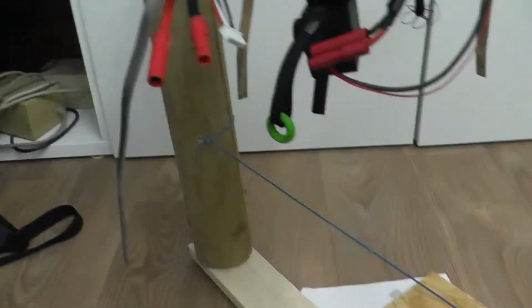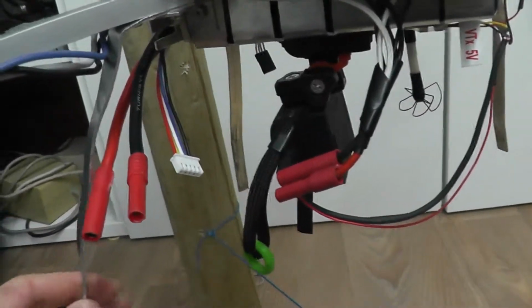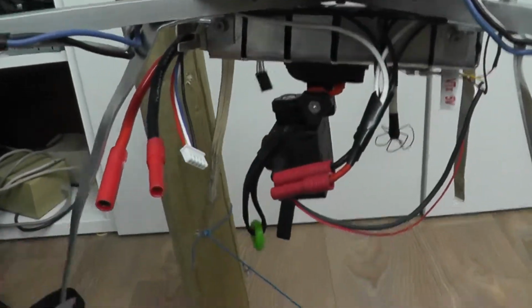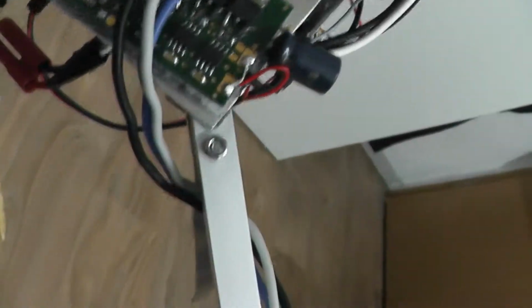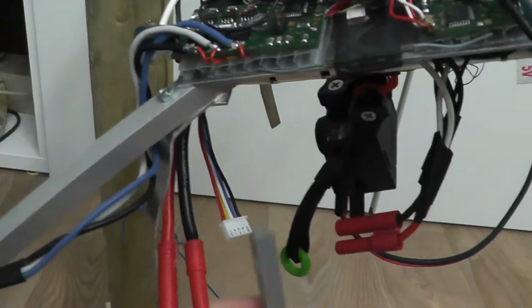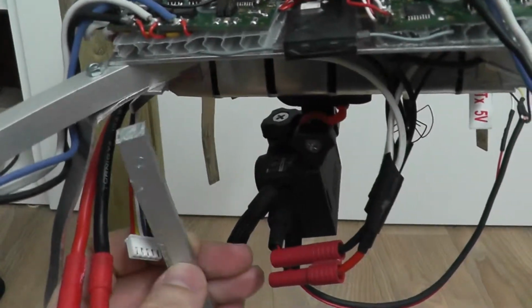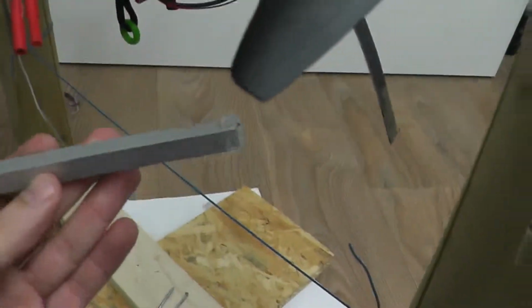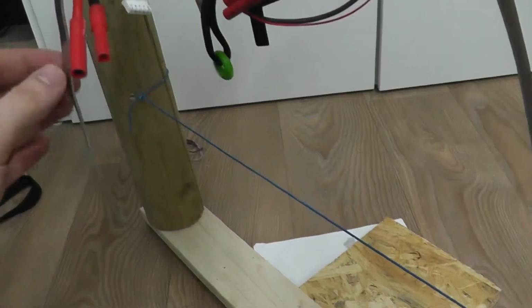So now a few words about the legs I'm using at the moment. As you can see, there are 4 small pieces of aluminium sheet, which have the positive effect that they are kind of springy. So if you land a little bit hard on the ground, they don't bend so easily, but instead act like a spring. But as you can sometimes see, they are a little bit bent because I crashed too hard. In this case, okay, they're kind of linear at the moment. But most of the time, if I crash too hard, I really have to re-bend them into shape, which sucks a little bit. At the start, I had these big pieces of aluminium profile, but these had some problems, because if I landed too hard, the screws holding them in place were bent, so I think it's better to have bent legs instead of bent screws keeping the structure in place. I have to say that plastic might be a better material for legs.